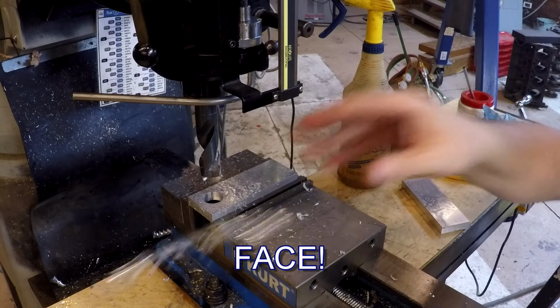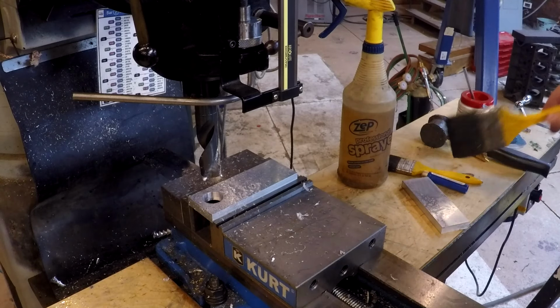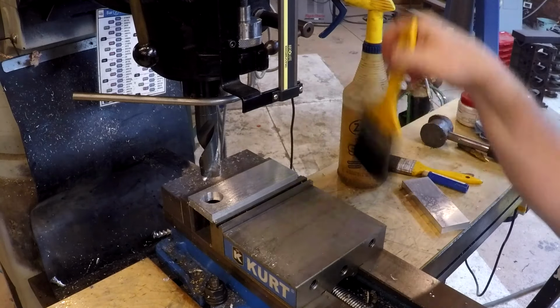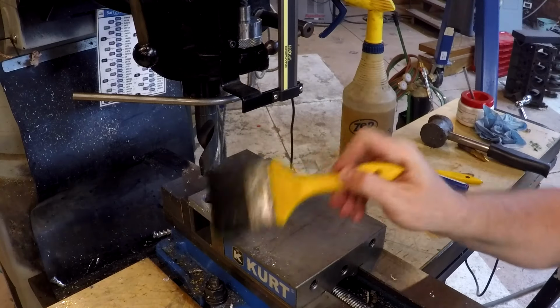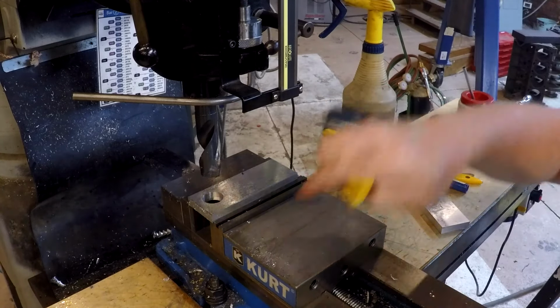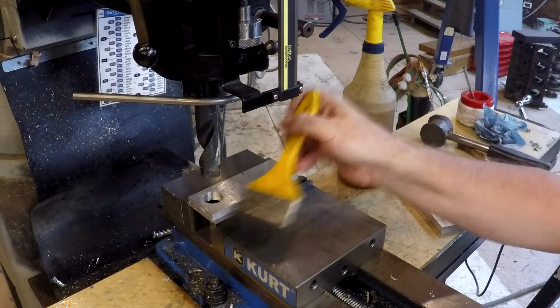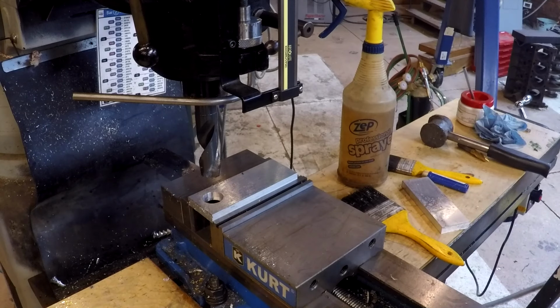Well, that was easy. That was 500 RPM, straight in with a 1-inch bit. And I hate using black oxide bits in aluminum because you get that silver buildup in there. That aluminum buildup, which is problematic. So let's go ahead and we'll swap parts, and then I will come back for the next operation.